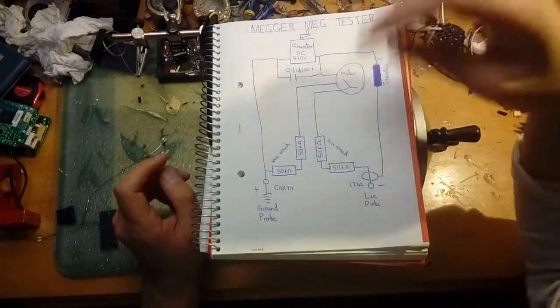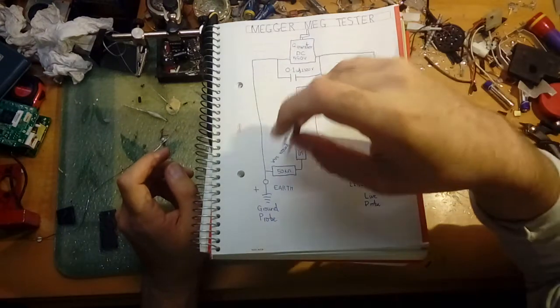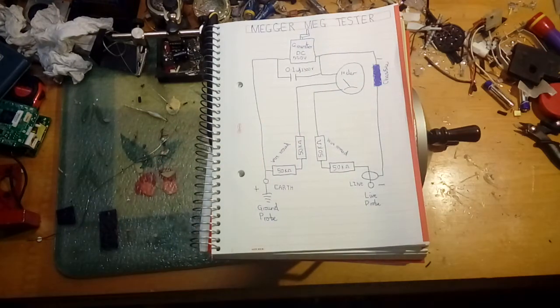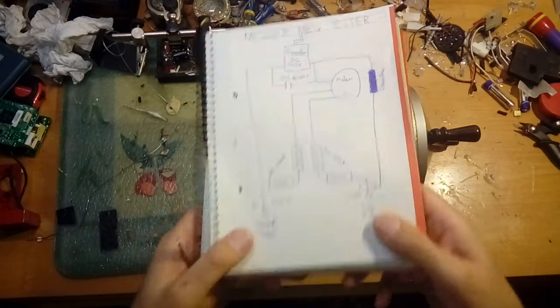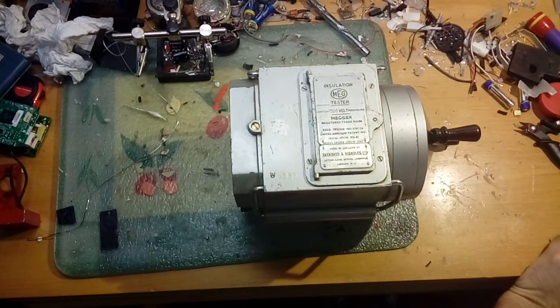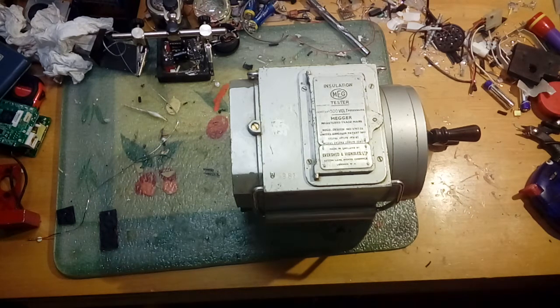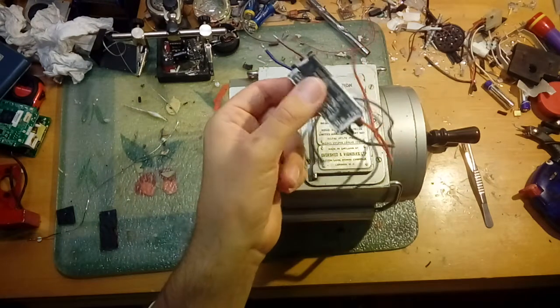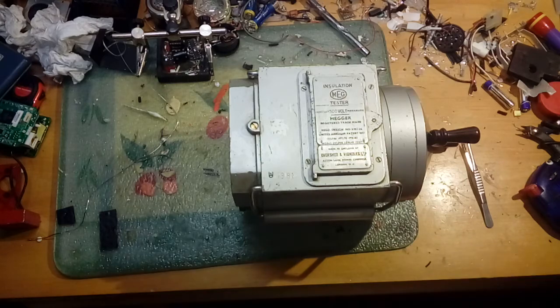The lead paint has made a mess over my bench already - but my hoover's got a HEPA filter so I can just hoover it up. I also had to take apart the back with the commutator section exposed to clean it with standard alcohol spray - in this case lens cleaning spray. I wound it around a few times, sprayed it on while winding, and fixed it all up good and proper. Thanks for watching - this thing met a real need for an insulation tester, it was dirt cheap, and sometimes you just need to test stuff like this to make sure it's actually safe.